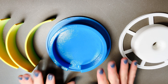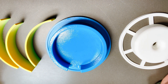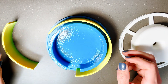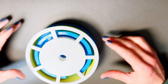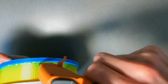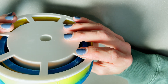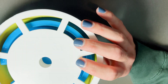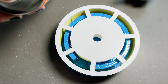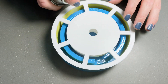This is nicely dried up, so I'm going to assemble and seal it up with hot glue. Doesn't need to look pretty, but we definitely want it to be silicone tight when we pour the liquid silicone in so we don't get leakage and end up with a hole where we're losing silicone and the mold gets shorter and makes a mess. I think this should do the trick. I'm going to hit this with some mold release just to make it a little easier to come out of the mold.